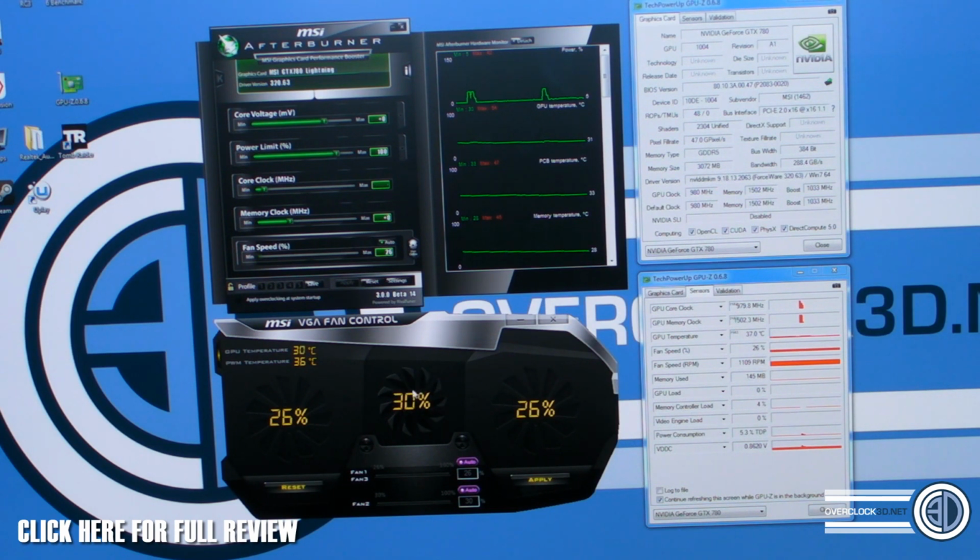But it's kind of weird because this fan is actually pretty much covered up by the heatsink, and there's no direct path down for any of it, and it doesn't actually contact with anything either. So through the tests that I've done, altering the speed of this fan hasn't really made a massive amount of difference to the PWM temperature up here, which is meant to change.